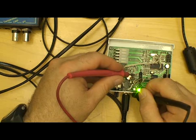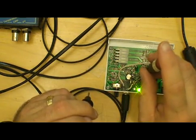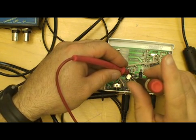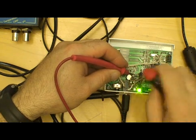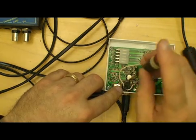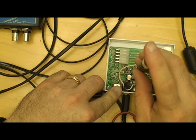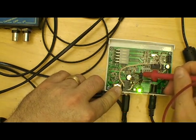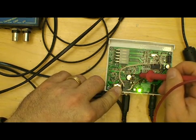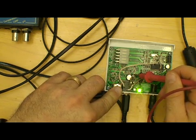What I'm going to do is check it — my potentiometer, you can't see it, it's just kind of out of sight there. It says 4.7, so I'm going to turn the pot just a little bit here. It now says 5.04. We'll turn that down just a teeny weeny bit and see what we've got. Went the wrong way — it's backwards the way you think it should be. You turn it to the right to turn it down. And 4.88 — a little too low. I could play with it like this all day long, but what we want is just right at 5 volts. 5.02. That's probably close enough — 5.01, 5.02.